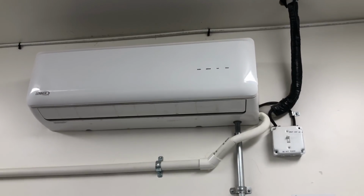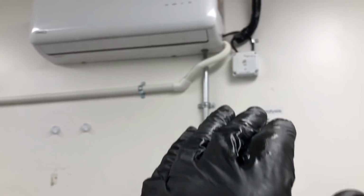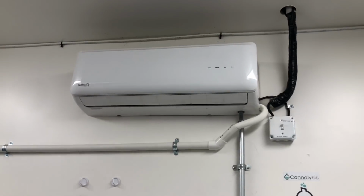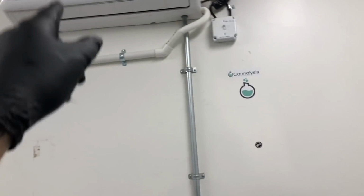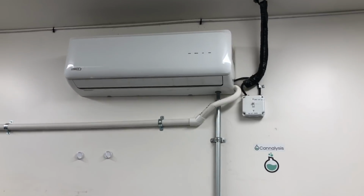Okay, there's one room they want to keep super cold. And then these other rooms, and I got to find out which head is the master. This isn't a unit that has a branch box where you can have one system heat, one system cool. It's just a standard 3-head system. So if the master gets set for heat, like if this person working in here is hot and they set the master to heat, the other two units aren't going to cool if they want them to cool. So you have to gather the whole story for your system and how it's being used.